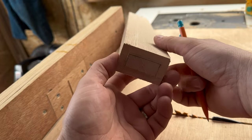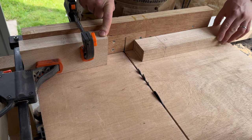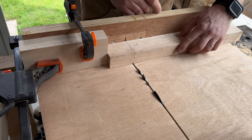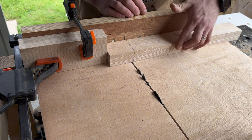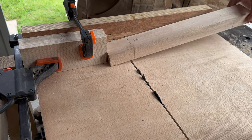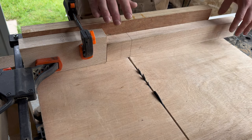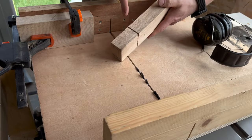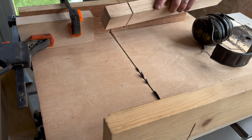You can see I've got quite a clear representation of how the tenon is going to look. I've added a stop block here so I can quickly profile all these tenons and get the shoulders cut all nice and square, nice and quickly, so I can run the blade all the way around. I know it'll be the same on both sides, and for all of the tenons I just flip them and use this as a reference. That's set the height of the shoulders of the tenon, so now I can just blitz out all this waste material.